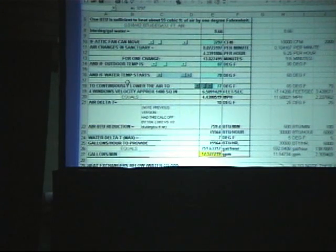And the same thing: if the water temperature starts at 70, that's one thing, but if it starts at 55, you can see the GPM required drops a lot. The power is in using the spreadsheet once we've measured some data. If we decided we don't need to cool below 80 instead of 77, then that changes the GPM required. So these are all the trade-offs.